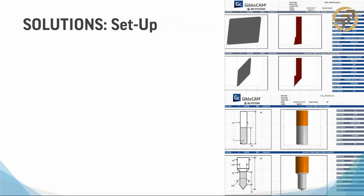If I went back to one of those first slides talking about the machines, there's a lot of moving parts there. There are a lot of tools to offset, tool numbers, tool holders. There's a lot of things that can be added to these machines that may not be modeled in a regular CAM system. What we call that is intermediate tooling. It's like a right angle head. It's anything that goes in between the tool and the tool holder. Some may have high RPM spindles that go into the holder, third party high RPM spindles, air spindles. That would be intermediate tooling.